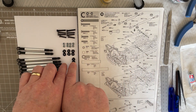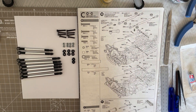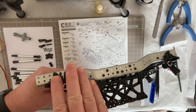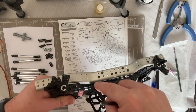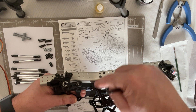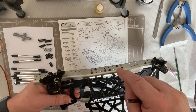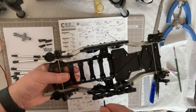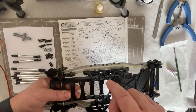Using the remaining hardware and spacers, we have the front section and the rear section. We need to attach the chassis links to the chassis — this is the front and this is the rear. Turning it to match the drawing orientation, we attach the short chassis links through this hole here using the hardware in the drawing and the D7 spacers down here. The longer chassis links go to this section on both sides, using the correct hardware and the D6 spacers.